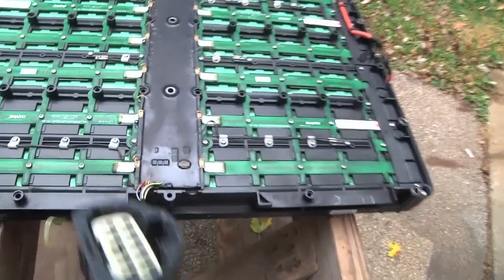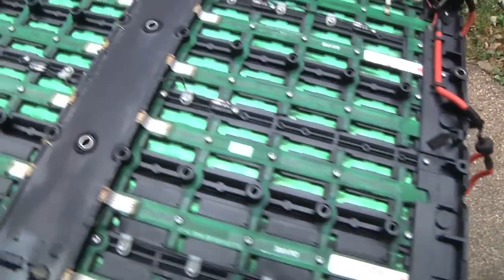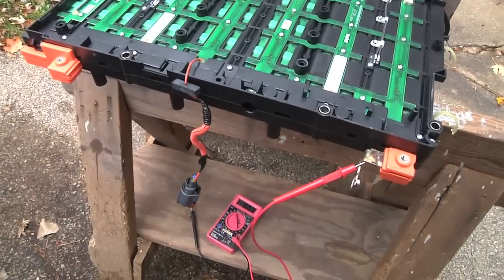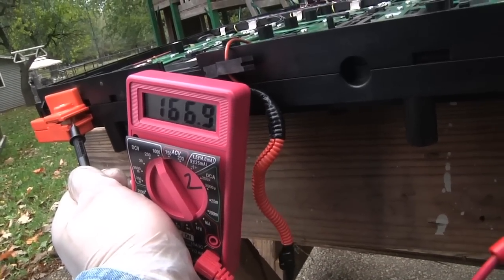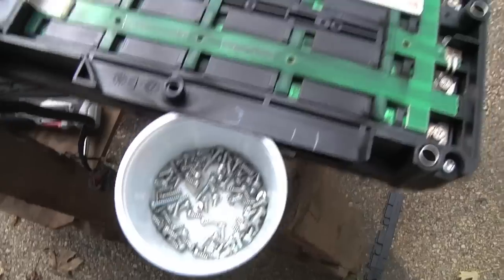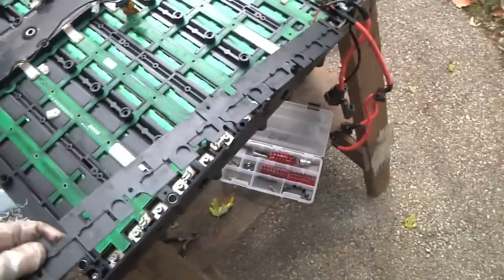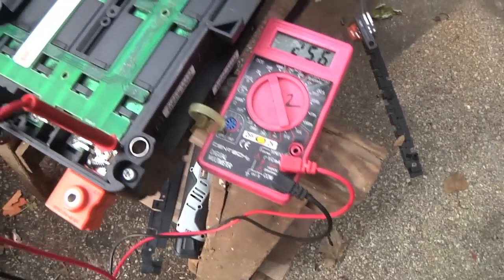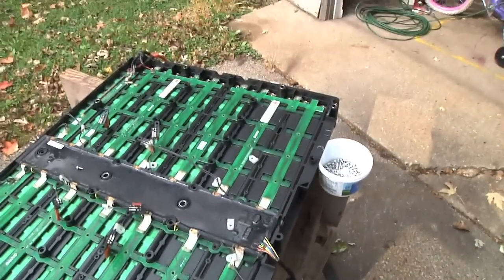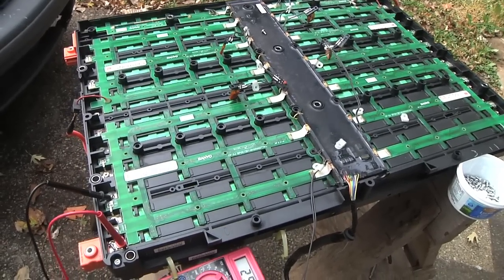There are still a couple of orange wires coming off, so I'm going to avoid touching those. Over on the power output end, it should be roughly 150-volt nominal — it's reading about 167 volts. I got all the tiny screws out that hold those circuit boards, and they also hold on an end cover piece that exposes the high voltage terminals. Throwing a multimeter on there, it's about 25 volts between every other row — so from here up to there, around and back, is about 25 volts per double row. There are 13 rows, double-wide out and back.